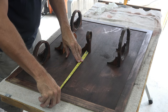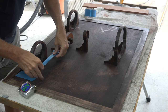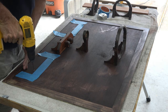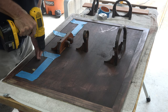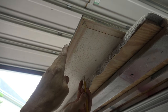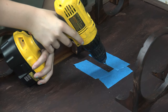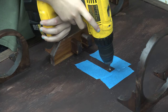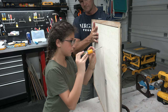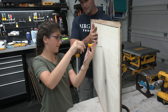Once everything was positioned correctly, I took some painters tape and placed it along the outline of each object to give me boundaries for where to drill my holes. I placed two holes in each spot, each hole under the location of the shelf itself — I did not drill into any of the shelf feet locations, as those were just for decoration. I put the shelves back into place and with a pencil marked the bottom of each shelf to put pilot holes in them. I only did this because the shelves are hardwood — you probably won't need to. Repeat the same process for the snitch shelf. Once all your holes are drilled, you can begin attaching your shelves — screw them in by hand since birch is not the hardest of woods and you don't want to drill through your back plate.